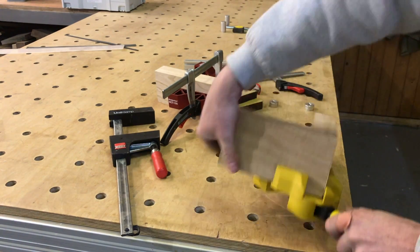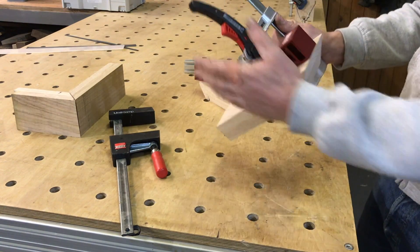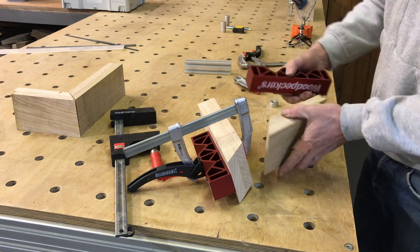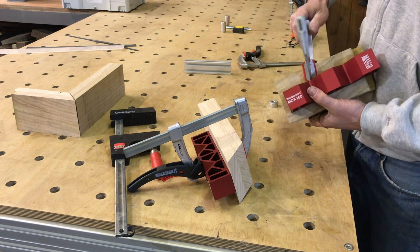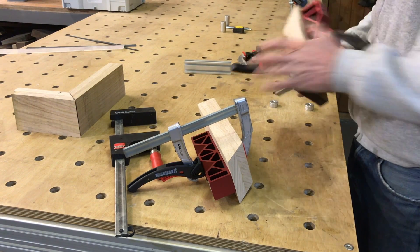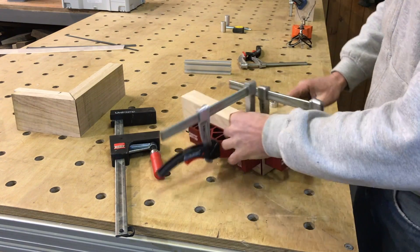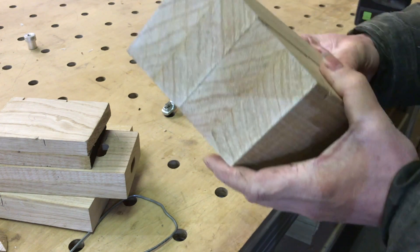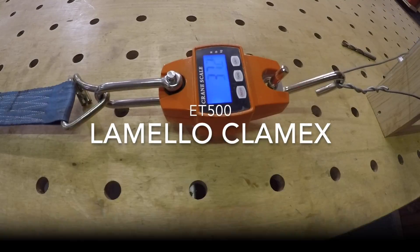You saw how I clamped that using the Woodpecker clamps. You can forget using a standard clamp on large stock - it opens the joint up and the bottom isn't good either, it's really off. For big stuff that sort of clamp is absolutely useless. I'd prefer to use this one I picked up in the States from Woodpecker - it works really well, though it's a little fiddly on smaller stuff. Once you get it centered it's pretty good. That was by far the weakest joint and the most difficult to glue up.